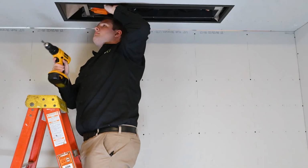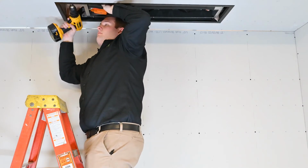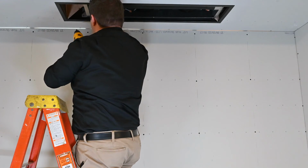Using the washers and hex head fasteners provided, fasten the assembly to the mounting flange at the 2 connection points opposite the hook end of the unit until they are snug. Please note that the holes within the fan coil chassis are slotted for ease of leveling of the device.